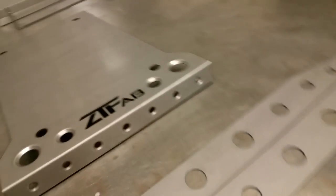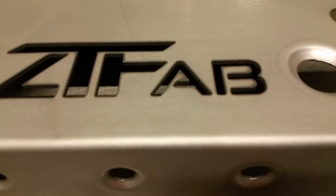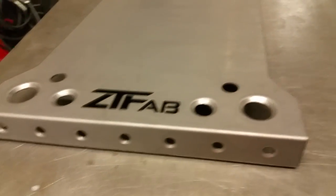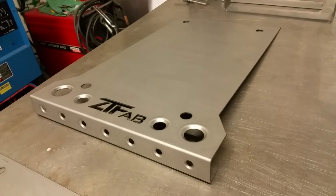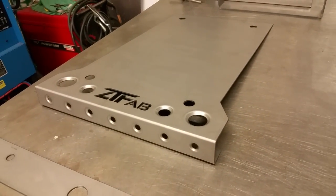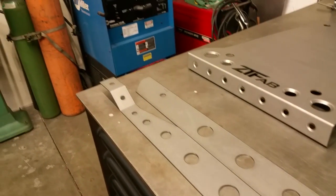And another layout table, and some more of the cut-outs. And that's the base to our welding carts — that's 12 gauge hot-rolled pickled and oiled steel. Everything is ready to weld when you get it, and easily accepts paint because it doesn't have the mill scale finish on top of it. So your hot tickets are the welding carts and the grinder racks? Yeah, we're doing about 6 welding carts a week and about 5 to 6 grinder racks a week right now.